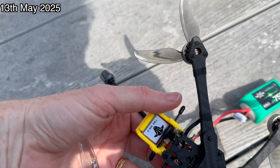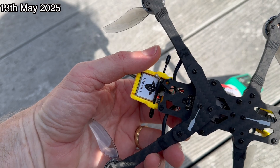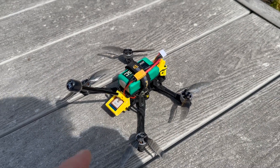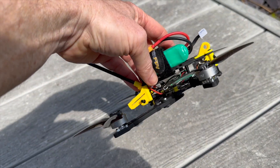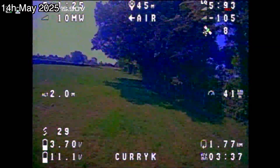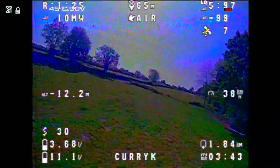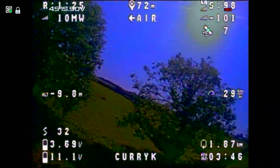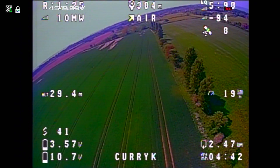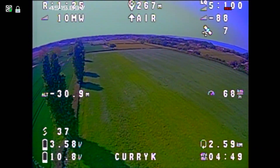Although that original GPS seemed to give lots of satellites when it had the SPI receiver, I had an old TBS GPS lying around so I thought I'd try changing out the GPS and see if it worked better. I was getting satellites in the garden, good enough to go out to the field and give it another try. For the first few minutes I thought it was holding eight sats and doing all right. Then we had that little dip again — went to seven, then to six. You could say it's just flying under a tree, but it just kept happening. When you've got the whole sky ahead of you and it still goes down to seven sats from eight, you think you can't trust this still.